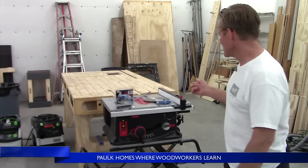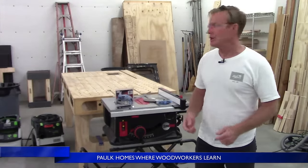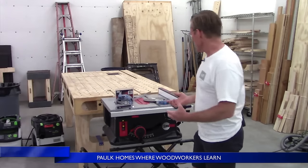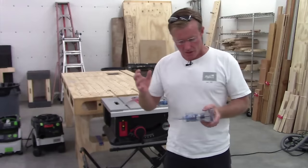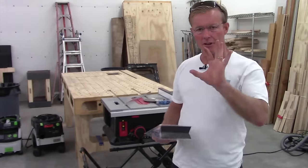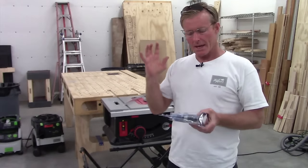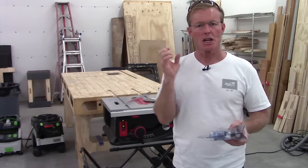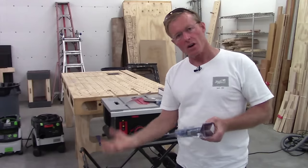I've done a few videos on my SawStop table saws that I've switched over to here in the last year. The namesake SawStop is a saw with a built-in brake system — if there's any conductivity on the blade and it's touching your hands, it will take this brake and, much like an airbag in a car, slam a chunk of aluminum up into the blade, stop the blade instantly, and then the whole mechanism falls below the table.